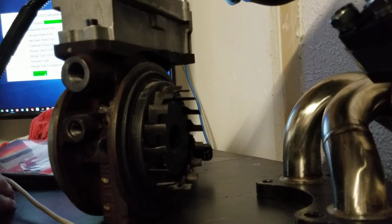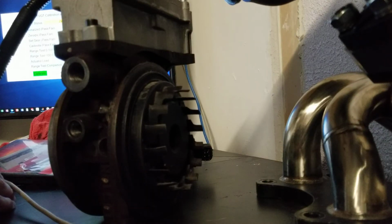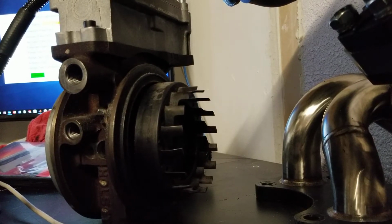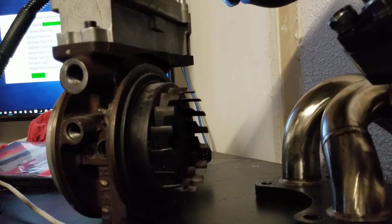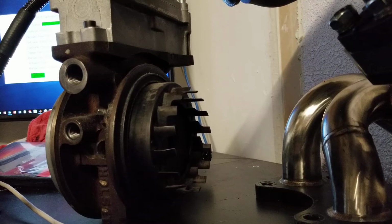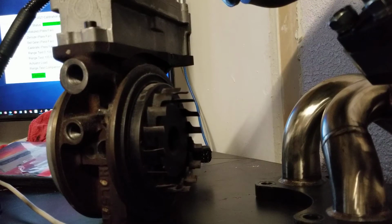So with the HE300s, you generally don't have to remove the actuator. Still good practice to do it, but the older ones, the 351s, the 4 and 500s, they still rotate the gear. So right now it's calibrating. And now it's doing the range test, 0 to 100. Hundred passed, now it's counting back down to 0. That's it.